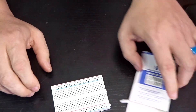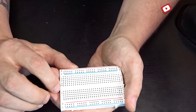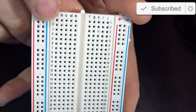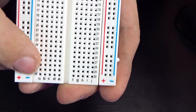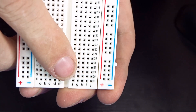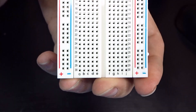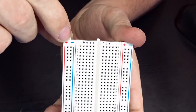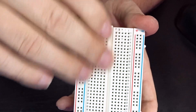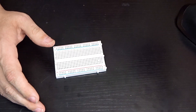So let's go ahead and open this up - there is our breadboard. If you're not familiar with these, basically you've got your different rows from 1 all the way down to 30, and then columns A through E are all on one rail, and F through J are on a separate rail. There's a break in the middle, and on either side you've got a positive and a negative so that you can send power and ground through your Arduino.